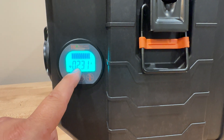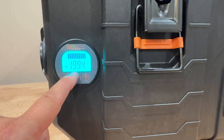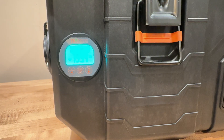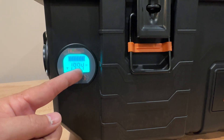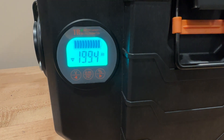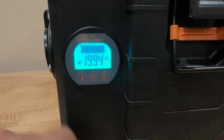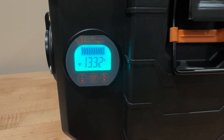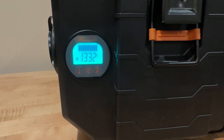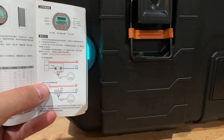You can see it's pulling 0.23 amps and it's a 200 amp-hour battery. It does draw a little bit with those switches constantly being on, so there is a small amperage draw, but it's not much. I really do like this display — I left a little protective sleeve over it and I'm going to try to leave that on as much as I can. When you hit your voltage button you can see it's pulling 13.32 volts — really easy to use and easy to set up.